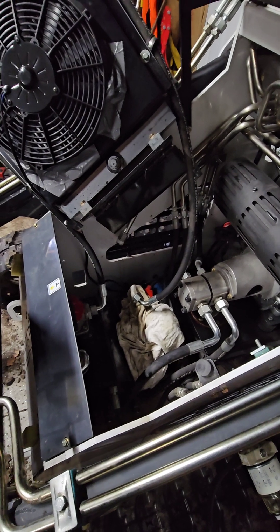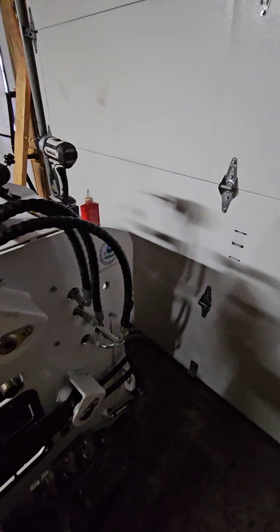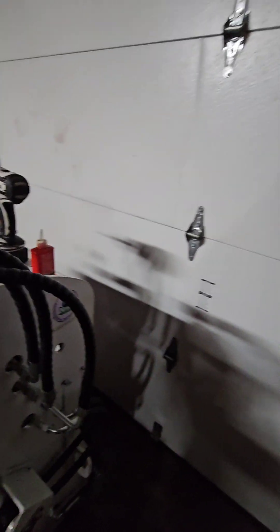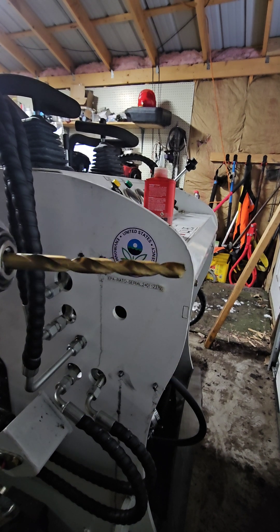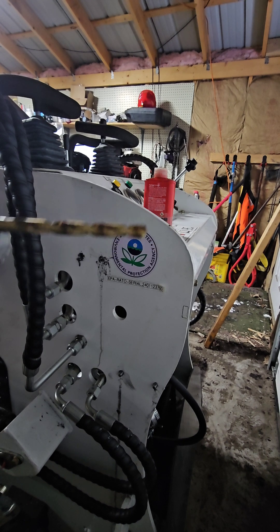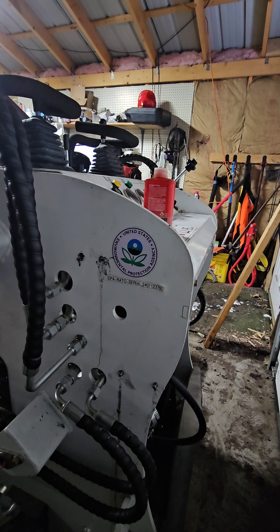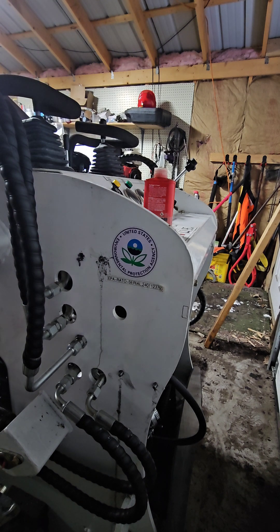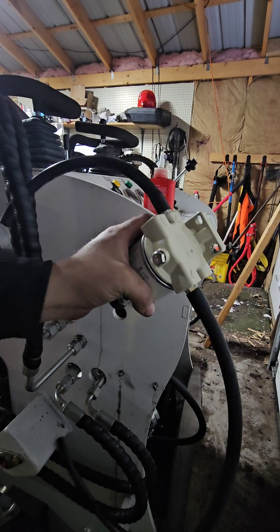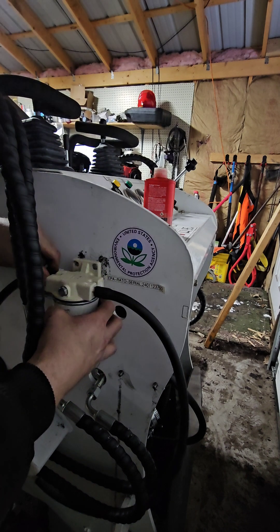So we're kind of jammed up a little bit back here and the lighting is not very good, so hopefully I can set you up where you can kind of see. The bit I'm using is a 5/64th cobalt bit and I'm using cutting oil and the trusty Makita. What I did was I took a piece of paper and punched out the holes where my filter's at, or you can just sit the filter up here and then proceed to get your holes in there.